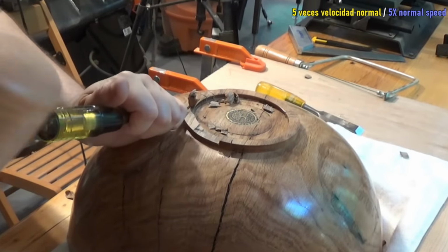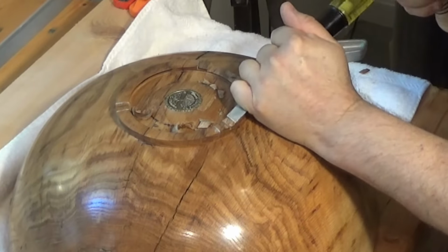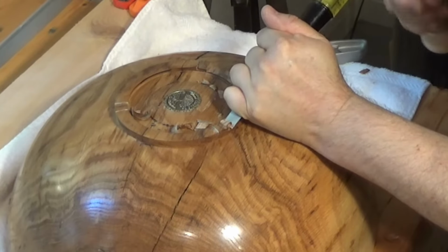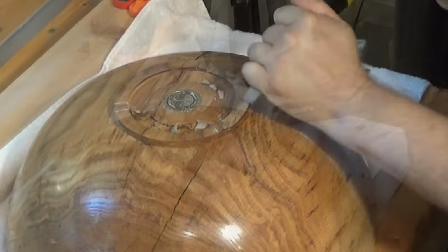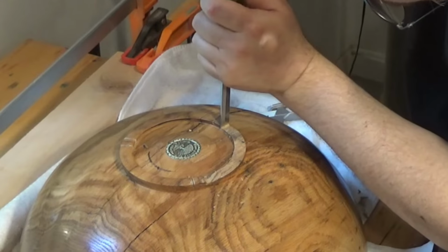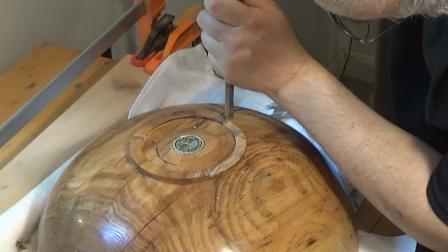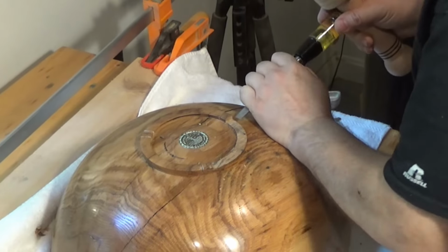As I get closer to the other leg and the cut I did with a hacksaw, I had to be very careful and deliberate with the hits that I make. Lower their intensity since I do not want to damage the wall of the other little leg. Since the cuts with the hacksaw did not reach the bottom, very carefully and with measure, I used the chisel cutting edge to deepen them up to the point it is needed.